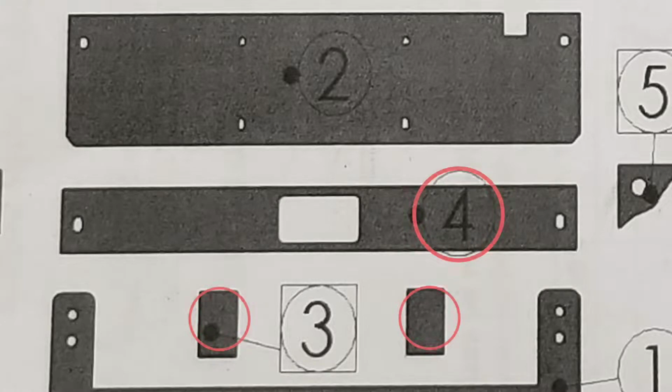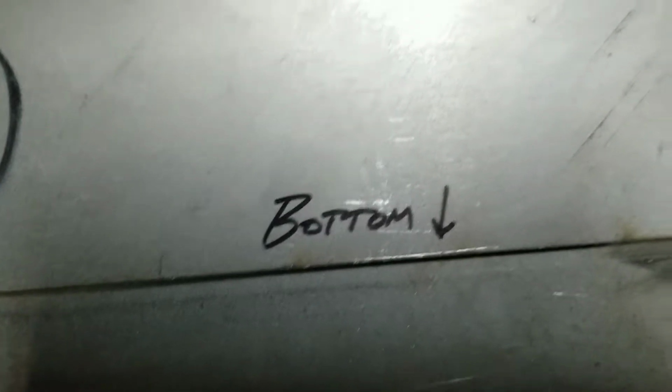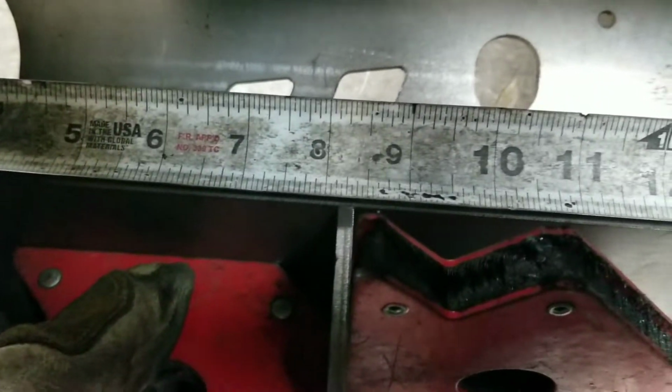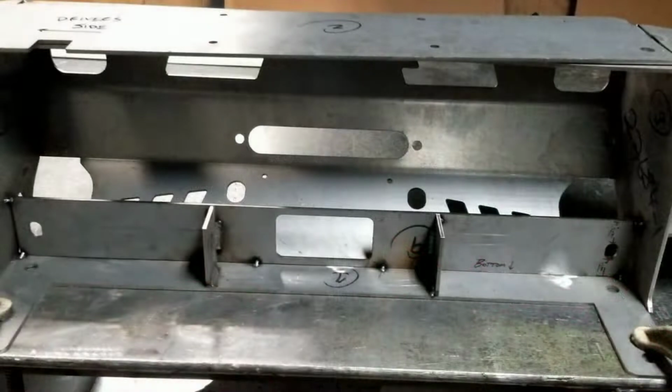This is where directions actually came in handy. They did mention something about this one. This fascia plate, make sure that oval hole is 1 1/4 on top and 1 1/8 on the bottom. Then I brought my 2 vertical pieces inward with my magnetic squares to roughly about 10" on each side.